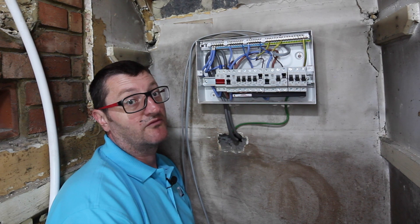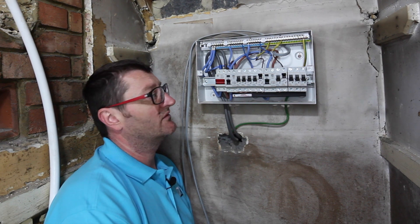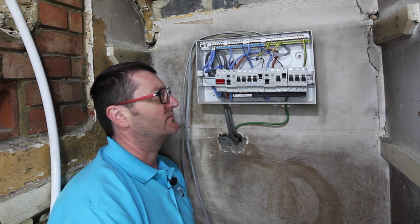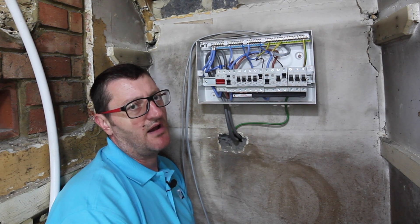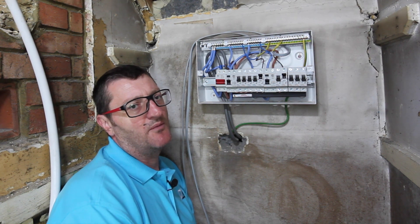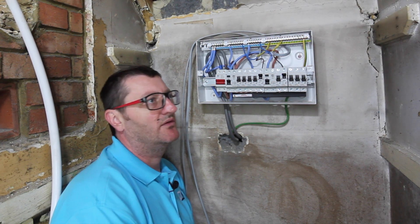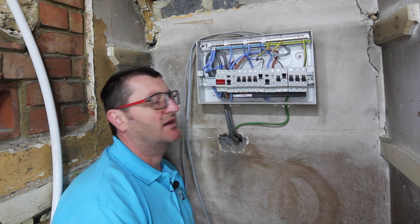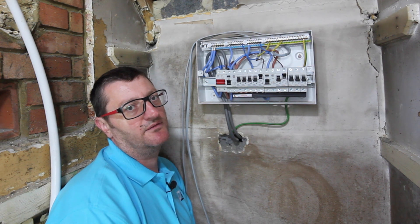I bought a fuse board with room for 10 circuit breakers. There are two reasons for that: it gives me a little bit more room to work when I'm putting the wires in, as it does get pretty crowded in there. It also gives a little bit of ability for future expansions — say the new homeowner comes in and wants to add a circuit, they can quite easily do it without adding another fuse board.